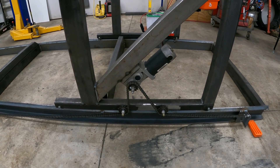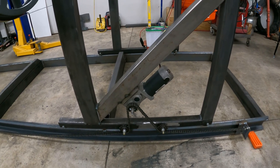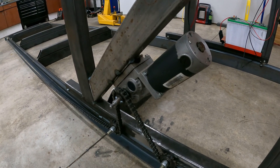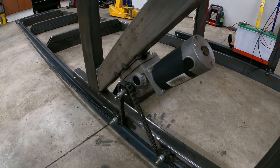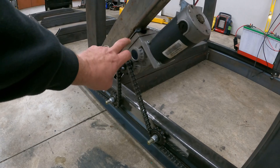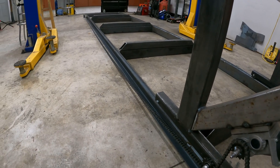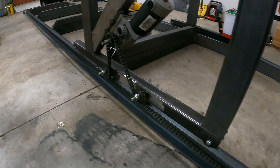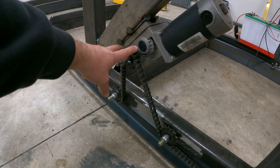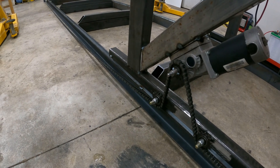The biggest accomplishment from the last video is the power feed that I've got completed. It's a jazzy wheelchair motor and I've got a couple of idler sprockets, some number 40 chain, and a gear here on the motor shaft that drives down this piece of number 40 chain from one end to the other. The motor will pull here and the idlers just direct the forward and reverse pattern.